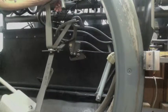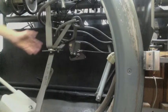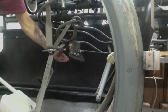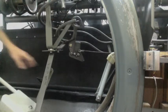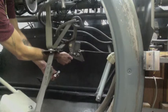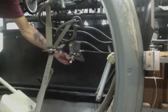Coming over to the even lane, you'll also notice that I've disconnected the lift rods — that was simply so we could shoot a clean picture for you guys so you could all get a good visual. Here we have our locking mechanism: when two balls are thrown at the same time on a pair, if one goes up the odd lane, as soon as the lift rods are engaged, it's going to lock that latch so that the second ball on the even lane cannot go by until the trip lever on the odd lane has been depressed. By getting rid of this little bushing and bumper and going to that magnet — with polarity 180 degrees apart — you can see where we're going to be able to perfectly adjust that so it's always going to have positive latching and unlatching. And you can see the power of that magnet as it just grabbed that bolt as I got close to it.